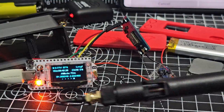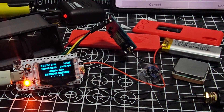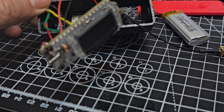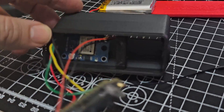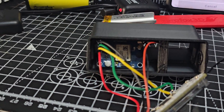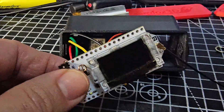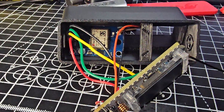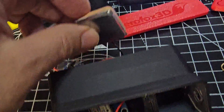I've got quite a big antenna here, and I do have a base station antenna outside as well to see if we get a couple of contacts. We've tucked the larger board in at the back and poked the battery through as well. We need to get the antenna through that hole — we need to go underneath this black line here, which holds the Heltec board in place. We're going to push everything into place. You could make the wires shorter if you need to.